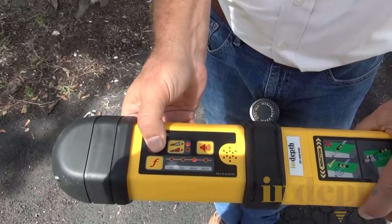What we want to do is place it on the ground over the top of the line, perpendicular to the line, so that it is applying signal to the tracer wire that's buried. I see that there are already some markings, so I'm going to put it perpendicular.